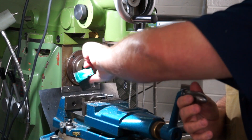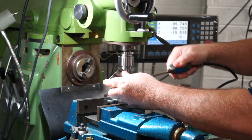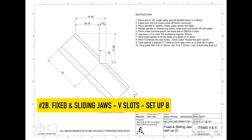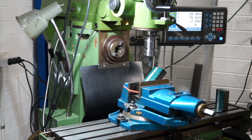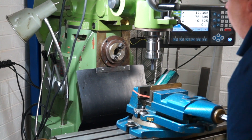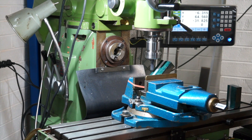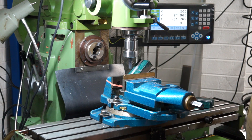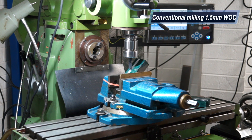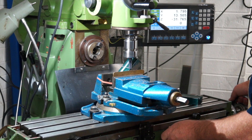Cutter has stopped and out of the vice it goes — have a look at that. You'll also notice that I mark out my jaws. My Dykem layout fluid must be off because the colour went from blue to green. Flipping it up on the long edge now — you can see my dimensions and instructions there. Touch off on top of the part, stepping down and winding the knee up to get my Z height. Coming in gently until I kiss the part and then set X0 — I'm at 31.7 there.